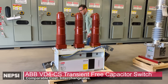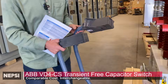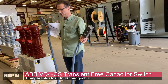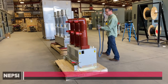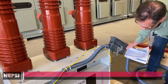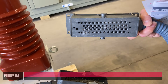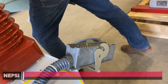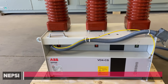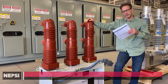The switch comes with a high-quality umbilical cord. One end connects to our equipment and the other connects to the breaker itself. The change-out of this system is very simple. The VD4CS also has two trip coils — we typically use one for protection and one for control. One issue we've had with the Southern States cap switcher is difficulty obtaining two trip coils when customers request them.